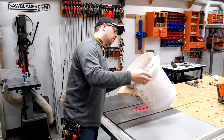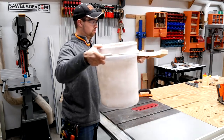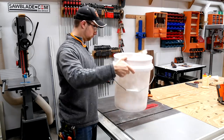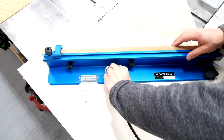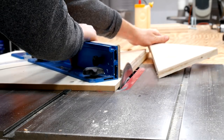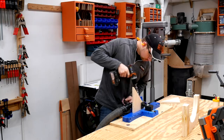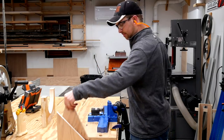Here you can see how the center point of the circular cut in the bracket itself was set back further so that it would curve over the bucket and hold it in place. Then a couple of 45 degree sections to hold the bracket against the wall mounting plywood. There always seems to be a place for pocket holes, and this project is no exception — I'll be using pocket holes to mount the bracket onto the wall and to hold these 45 degree sections against the bucket bracket.